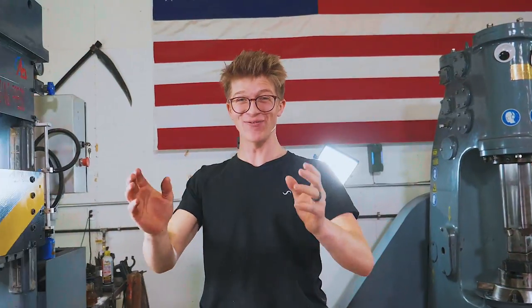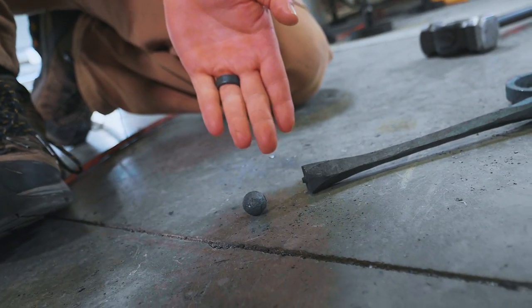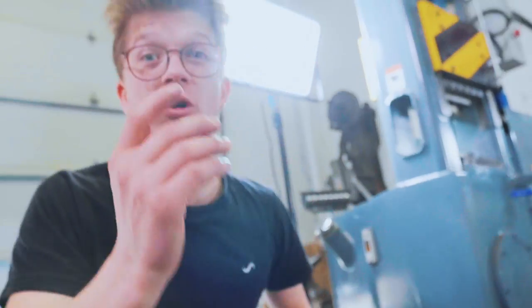I was done forging. It has fallen off. This was what I was worried about. I talked about this earlier. There's a concentrated area of stress right there. We wrapped it with wire, which did marvelously to prevent it from oxidizing and stop it flopping too much, but it hath flopped its last flop. It flopped too much. The wire could not help it.